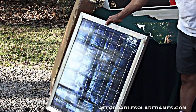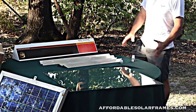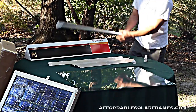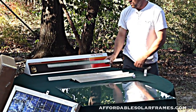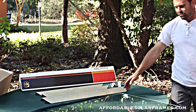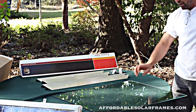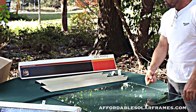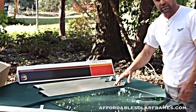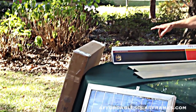It's a couple of years old. When you buy one of our kits, we offer all different sizes. It will come packaged like this. It's inch and a half aluminum, eighth inch thick, real simple to put together. The glass we use is quarter inch clear tempered — it's got a hundred mile an hour wind load on it. We sell this smaller size glass one at a time, two at a time, or with the frame assembled in a box like that.